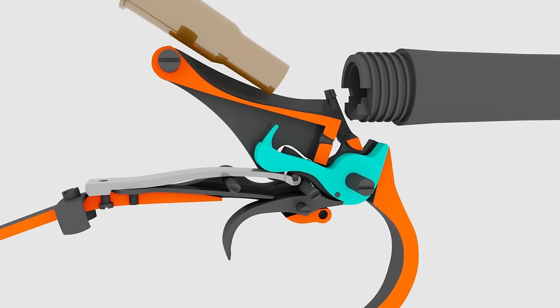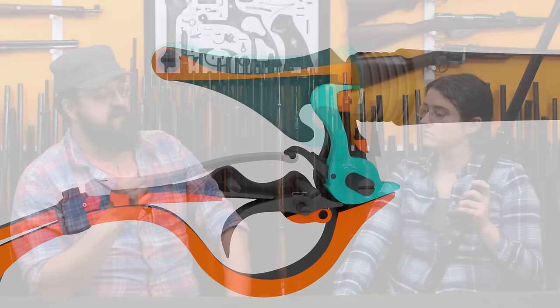Okay. And so when they did that, they created a situation in which you have this impossible position for the trigger in order for it to function correctly with the available rigidity of metal that they had for how they were constructing this. Sure. So what you've done is you've shoved the trigger all this way forward at this weird angle, which is why we're pulling up, so that it can reach the hammer properly. In theory, even with those problems, you can lighten the trigger pull by lightening the hammer, but you need to be fairly heavy in order to strike a pop primer.